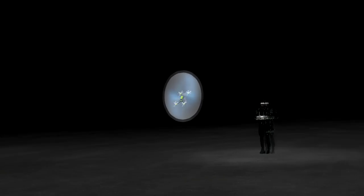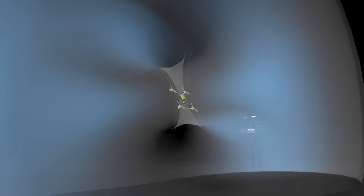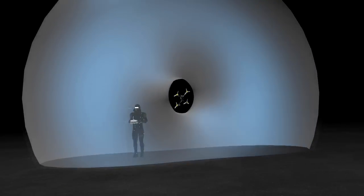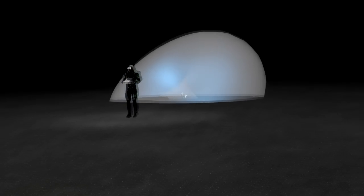Here's what's happening. The antenna emits in a donut radiation pattern, and as you can see, the center of the antenna is effectively a null with very, very weak signal. As long as the pilot is within this radiation pattern, the video is fine. However, with some orientations and with distance, this gets weak, resulting in complete video loss and often a crash.